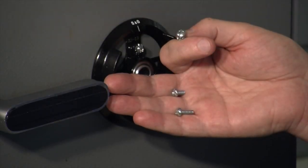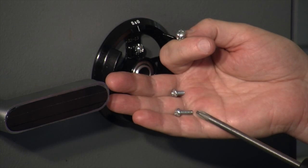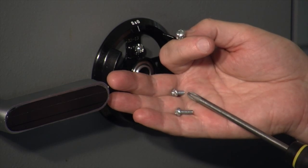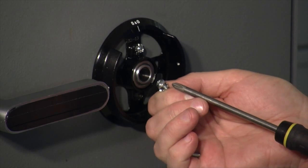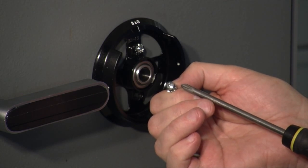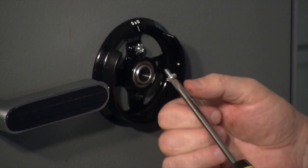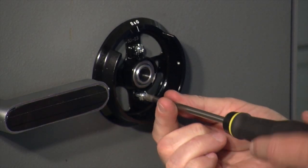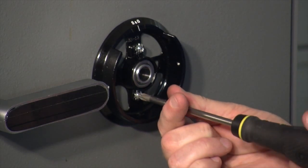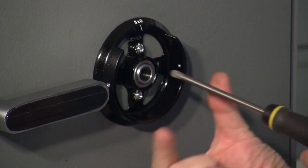Packaged with your 2740B lock kit are two different lengths of dial ring mounting screws — these are 8-32 screws. You should use the longer screws if the holes drilled and tapped into the front of the container are deep enough to permit it; otherwise use the shorter screw. Each one of those screws must be used with a lock washer underneath — a flat external tooth lock washer. This lock washer requirement is the key difference between the 2740A and 2740B. I've got the top screw installed and now I'm inserting the bottom one, leaving both screws loose so there is available movement in the dial ring.